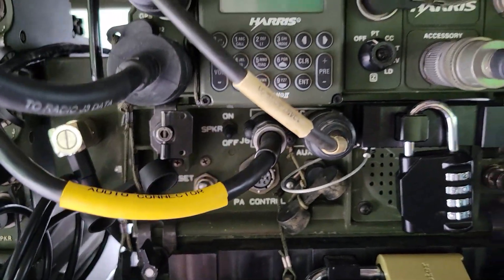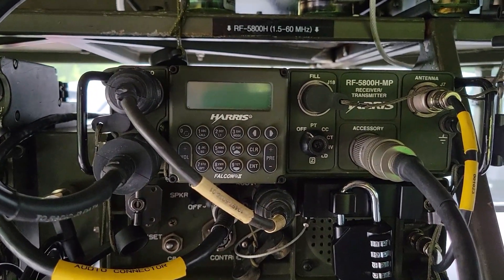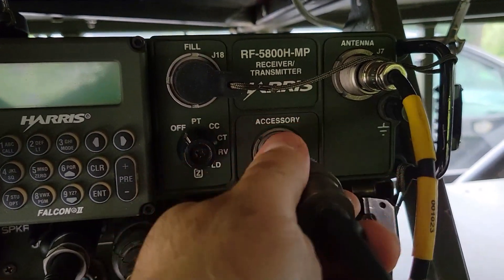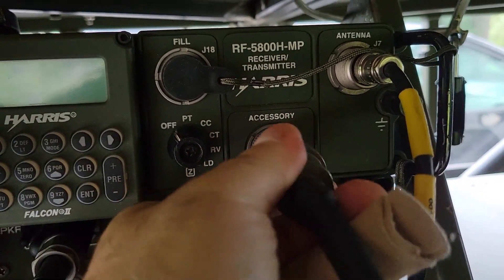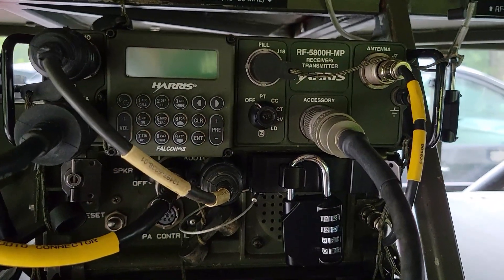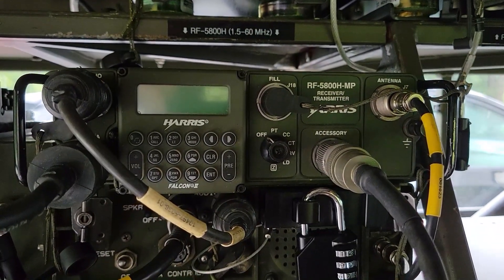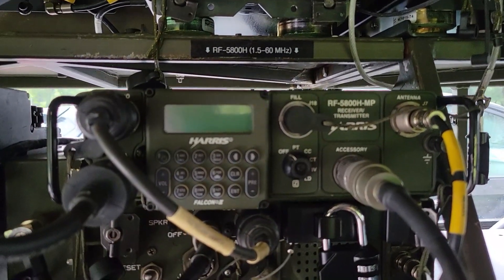So I got looking into the technical manual for the Harris radio, and what I did find is that this capability does exist. In this accessory connector - which is a multi-pinned connector here - there is a signal for radio on-off. And it also uses the same signaling: closed for off and open circuit for on.